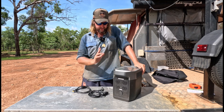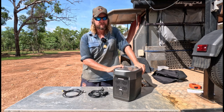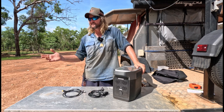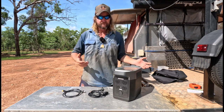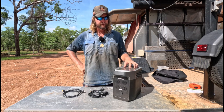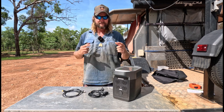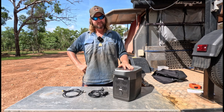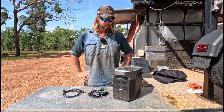You might get away with not having solar or a car charger if you just want to use it for a day or two. It may run your fridge for that long depending on where your fridge is located — if you've got it in the shade that helps. Down south in winter I reckon it'd have no troubles, but up here right now I realized how much heat affects solar efficiency once it reaches a certain temperature.